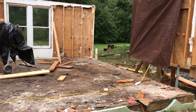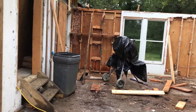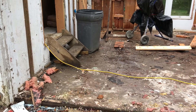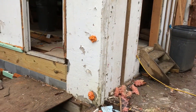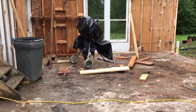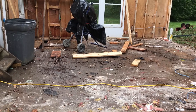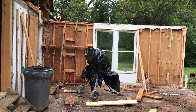Good morning, we're back in the demolition business. This is the one section of the house that is stick-built, so in order to get the floors and the whole section raised up the way we raised the other part of the house, we need to demolish it and then extend the block foundation up two courses and rebuild the addition on top of that extended foundation. We're taking this down — it's mostly down, a little bit more to do today.